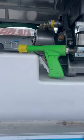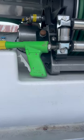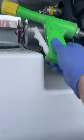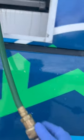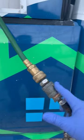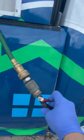If any of you have left a soda in the freezer, you know what happens. That moisture expands and it will crack anything that it's sitting in. So the first thing I do is I disconnect the spray gun, make sure any excess liquids dump out of there. Then once that's done, we have these quick couplers. We have a custom-fit piece here where I hook up to an air compressor and our working container there, and I start running air through it.